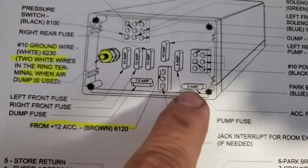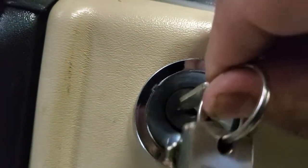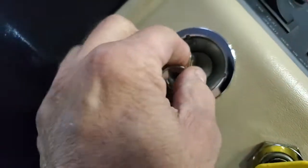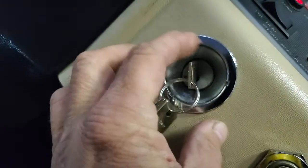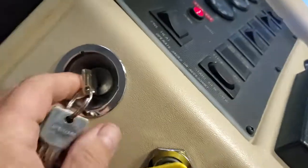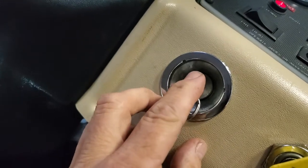So we got voltage in. It's supposed to go from there across the accessory fuse - ACC, accessories, key on engine off. There's your ignition switch position. Now remember the old timers - used to be able to go the opposite way with the ignition switch. There you go - that's off, and that's accessory. Notice the dash lights are off. Now watch - there you go, so that's key on engine off. If I turn it one more where the part bounces back, that's key on engine cranking, and it bounces back to key on engine running, which is the same position as key on engine off. Key on engine off - lights on, lamp test - and then crank. And it bounces back, so key on engine running, K-O-E-R, and K-O-E-O, key on engine off, for the same position.